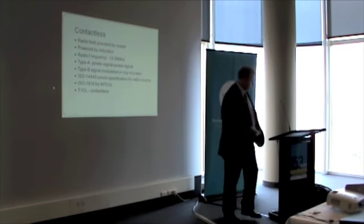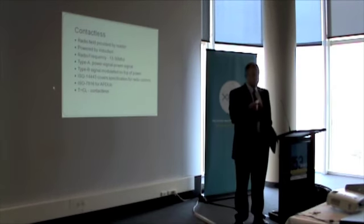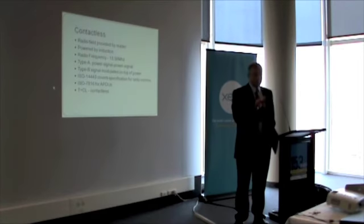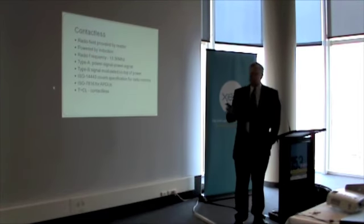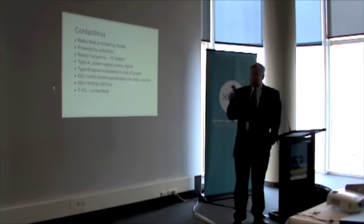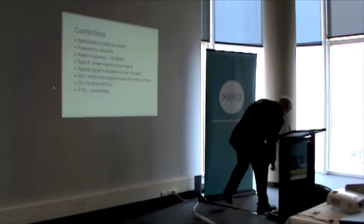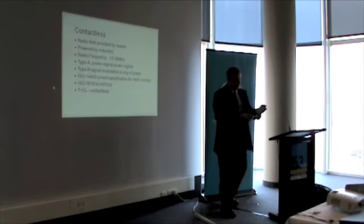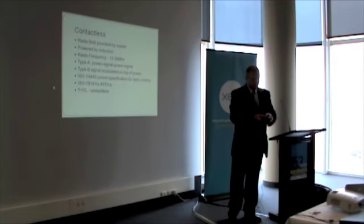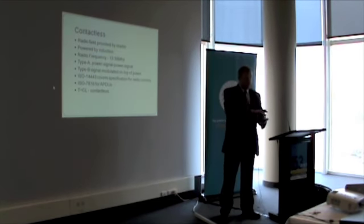Contactless, we've got a huge problem. We're not going to put a battery in these things, because otherwise you'd have the life expectancy of the battery, what's it, 3 years, and you've got to continually recharge them. So they have got around it by using the reader itself to power the device. So when you put your card onto, here's one I put earlier again, when you put your card onto a reader, the reader is emitting radio waves. So there's a hemisphere of radio waves that are covering this area.